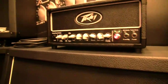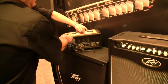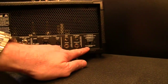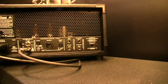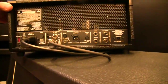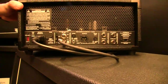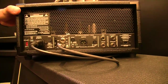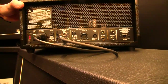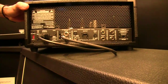So it's still got quite a good load of features, especially for an amp of that size. The other interesting stuff is round the back — all of these amps have this. Starting this end, we've got a USB out, so you can connect directly to a computer and record straight in. That's taken off the MSDI circuit, which stands for Mic Simulated Direct Interface, so it's a nicely filtered version of your sound that sounds like a mic'd cabinet — extremely important for guitar. You get a really great tone into a recording system, or into a PA via the XLR, which is a lot easier than using a microphone for live use. The engineer also has complete control over your sound without spillage from drums or anyone kicking the mic over.